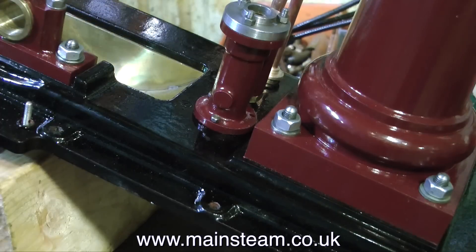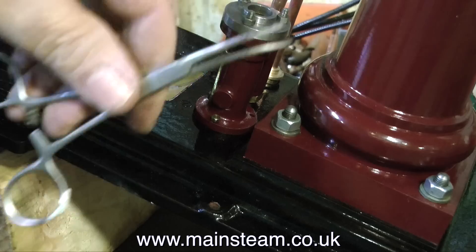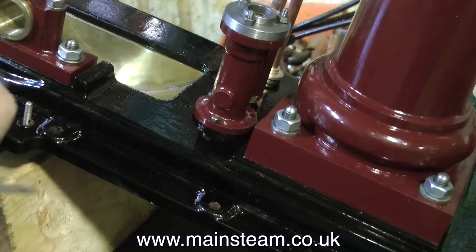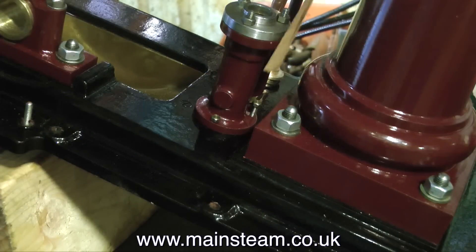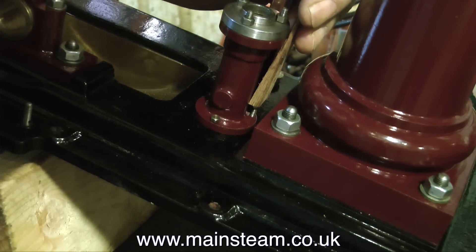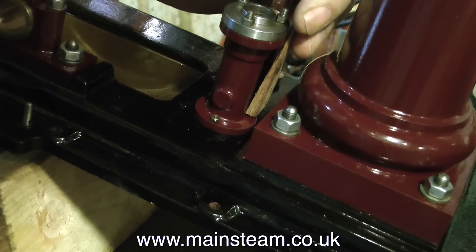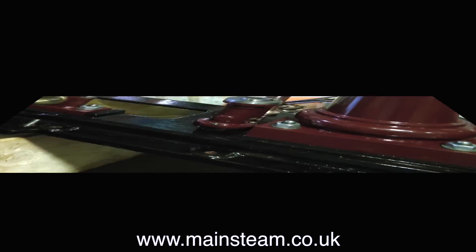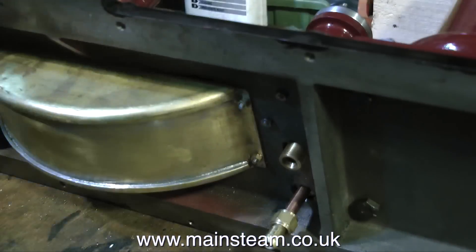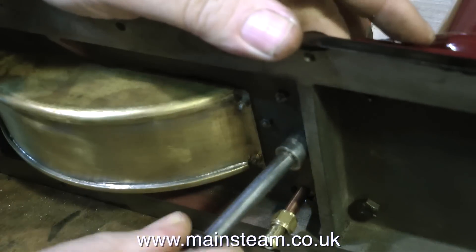Initially the thickness of the paint on the bed plate and the water pump itself made it difficult to get these bolts into place, but with the help of a pair of surgical forceps like this, it was much easier. Once the bolts were in position, I still had to tap them through the paint using a piece of mahogany, being very careful not to mark the paintwork. Carefully turning the engine over, I tightened the nuts underneath. One of them proved very difficult to start on the thread, so I used the forceps again for this.